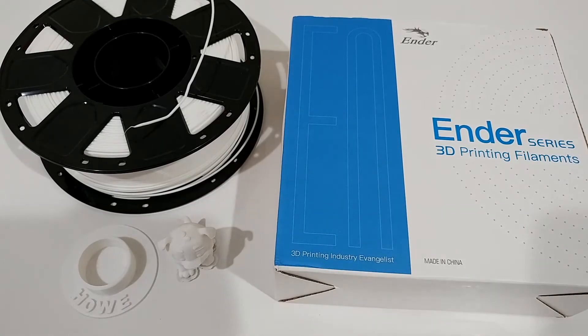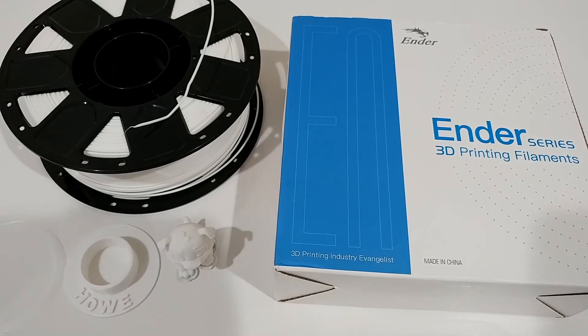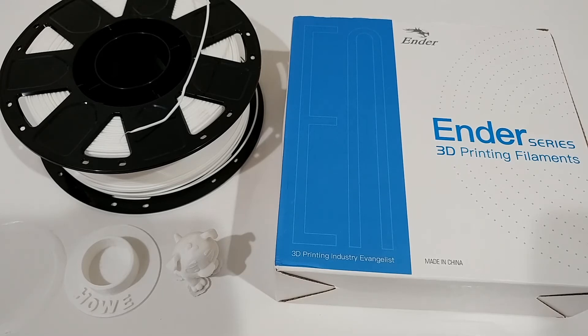I can only recommend staying away from applying many layers of glue — it can be too much. I was frustrated when it wasn't sticking and thought maybe it was this brand. So I removed all the glue with isopropyl alcohol, leaving bare tempered glass, and did a real leveling of the ANET ET5X. The ET5X has both manual and automatic leveling, but both work really quite badly — every time you check again it's not really level. I tried multiple times until I thought it was good enough.